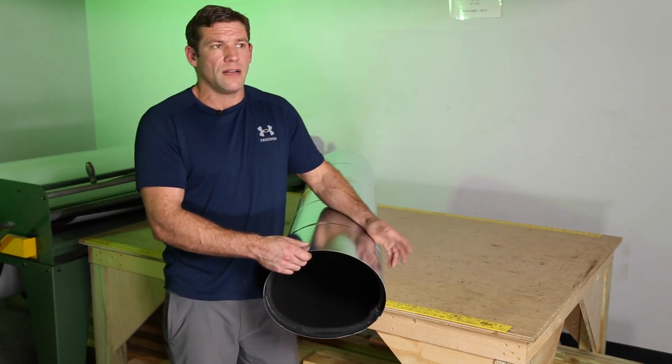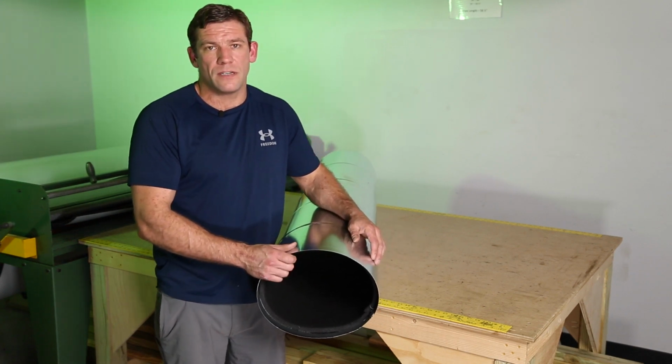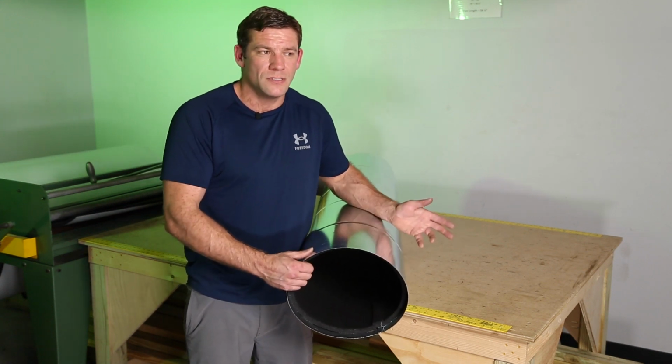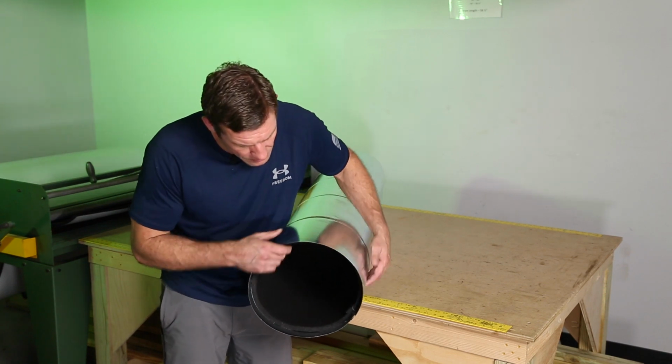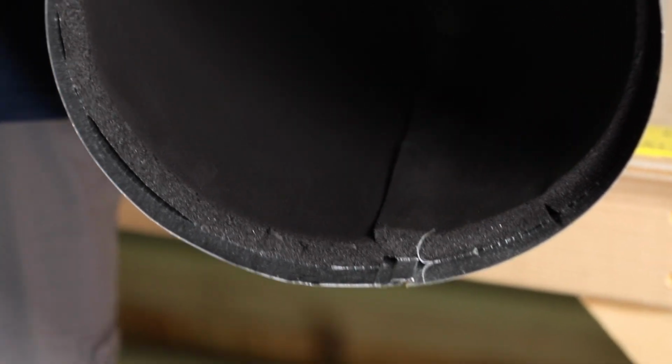Thing is, you now have like a 4 foot 10.5 piece of duct instead of a 5 footer. If the mechanic doesn't know that and he lays out his job, he's gonna be 1.5 inches short. Now, in heat and air, that 1.5 inches normally doesn't matter. What I've also seen people do, and I wanna mention it's a no-no, simply take some foam tape like this.